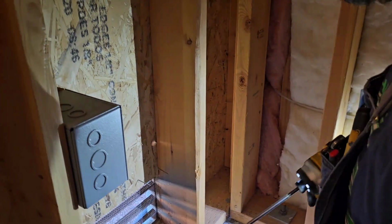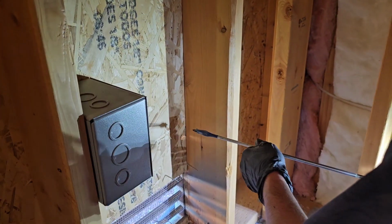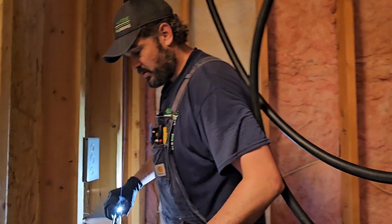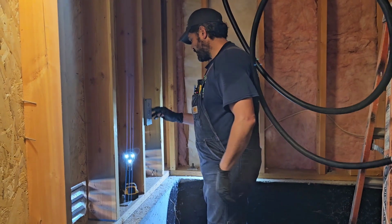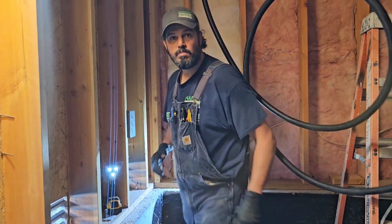You may think that's stupid, but these impacts are designed for short burst. Whenever you're drilling holes with impact, do that multi-trigger thing. Trust me, try it. You'll love it. It goes through material tremendously well. Okay, we're going to set up the hole saw on the chuck drill. So we'll just keep that there for now. And now let's go drill a hole from outside in. And then we'll have a target. Should be okay.